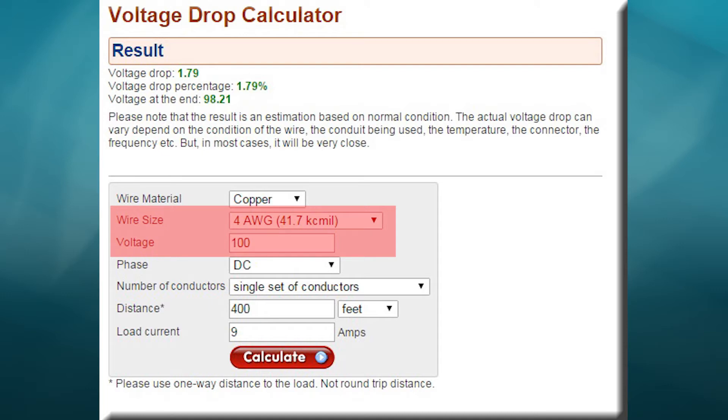So just give me a quick overview of why a 600 volt charge controller. Well, the 600 volt has proven efficiency as sort of the standard for high voltage arrays now, to allow for longer wire runs. You can reduce component costs — just in the wiring — reducing cost by being able to use smaller gauge copper wire. That can add up to substantial cost savings. It's the preferred way to do things on the world standard right now.